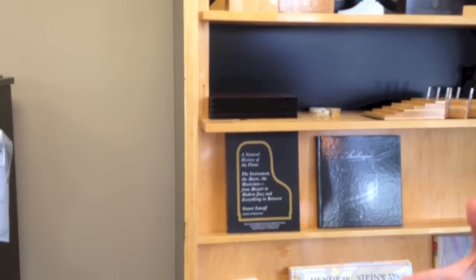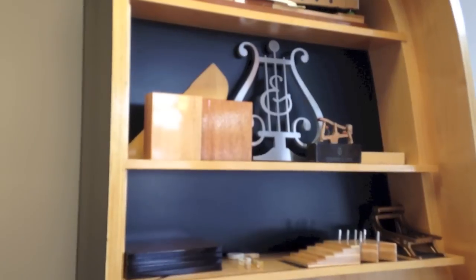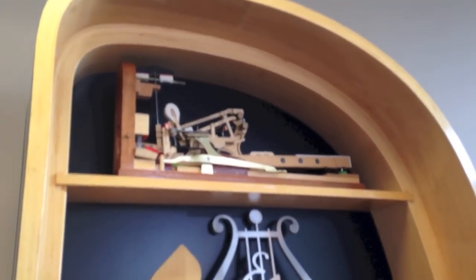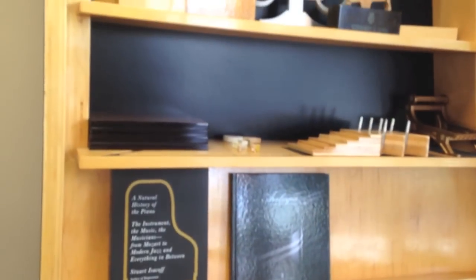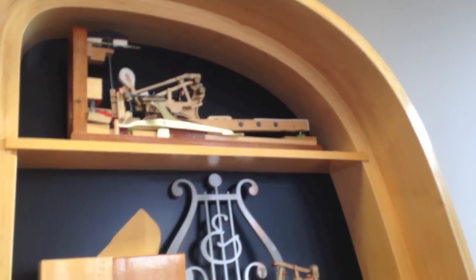All the wood sits for a year before we even plane it to see if it's good. After we bend the rim, it sits in a different room that controls humidity for six to nine months, so it can forget that it's straight. This is actually the real rim of a seven-foot Model B. And there's a sample action of a seven-foot piano — 57 parts have to move from when you push the note down to the hammer actually hitting the string. Where did the number 8,000 come from — does that refer to the number of parts in a piano? That sounds low to us. It's a little over 10,000 moving parts, and about 12,116 total parts.